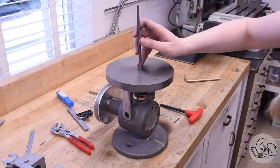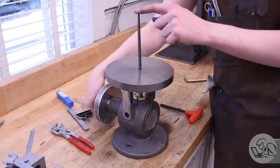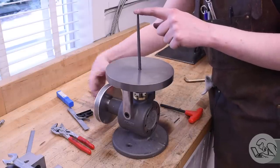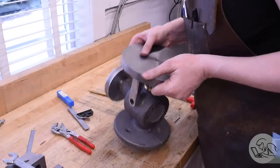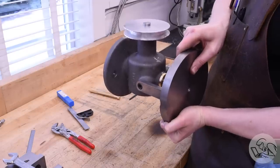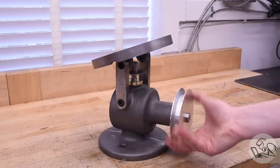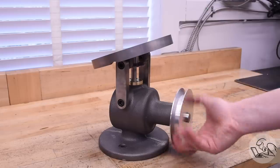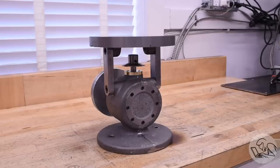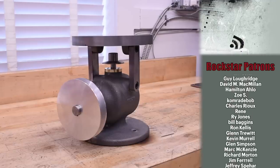I've got enough pieces to do some assembly — let's see if I did my job right. Everything installed really nicely. Let's temporarily put a file in there — this isn't a die filer file, just a hand file — to give a sense of how the file will go up and down and, well, it's going to file stuff. I had doubts from the drawings about the strength of these table legs, but they are very firmly clamped — I can tilt the whole machine around and nothing moves. You can see how the table tilts and why we put that cone on the underside — the file can still move up and down with the table tilted for angled filing surfaces. Very excited to get some files made and get the motor on this thing. That's all the time I have for you this week — thank you very much for watching, and thanks to all my patrons who make this content possible.